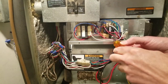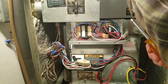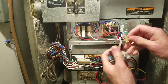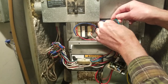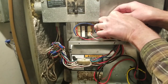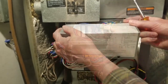I find it is easier to remove the old relay from the control box with the wires intact, mount the new relay, and then transfer the wires one at a time from the old relay to the new one. This reduces the chance of error. After the wires are transferred over, route the wires so they don't get pinched by the control box cover. Then replace the cover.